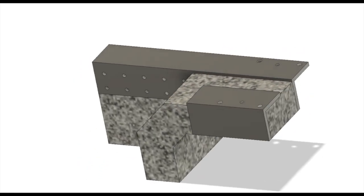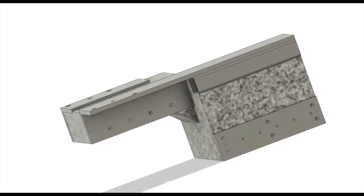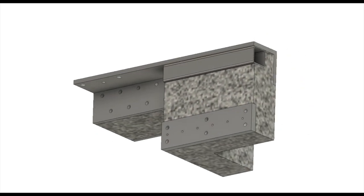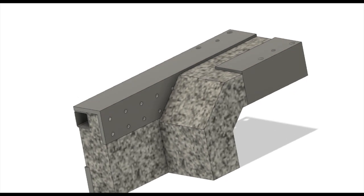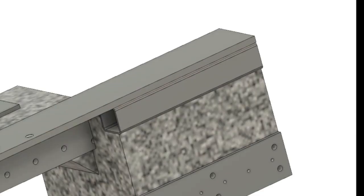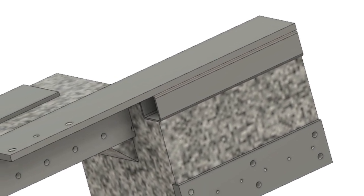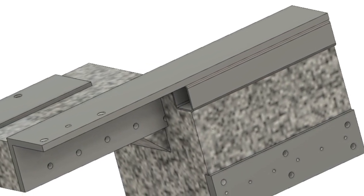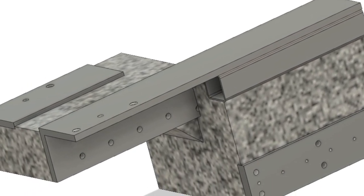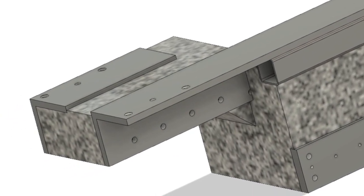Epoxy granite is an excellent material, but it has some disadvantages. It is difficult to drill or do additional machining after the epoxy granite has cured. This means that metal must be embedded to make threaded holes in the areas where headstocks, linear guides and other things like that are mounted. It is necessary to plan well where the metal will be embedded. Once the design is completed, the formwork is made. The formwork should be made with the idea of removing it later. Now let's make the formwork.